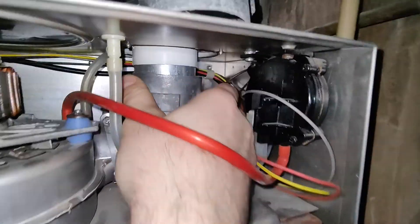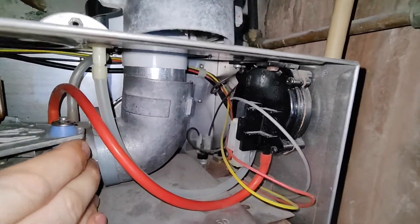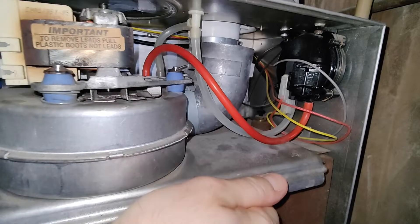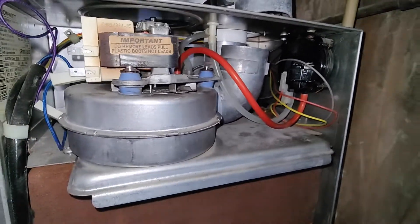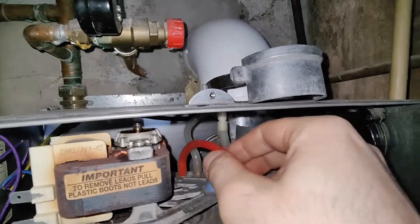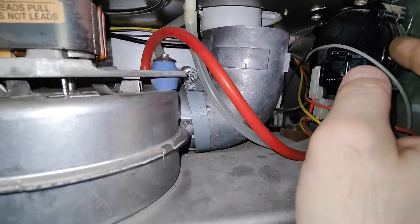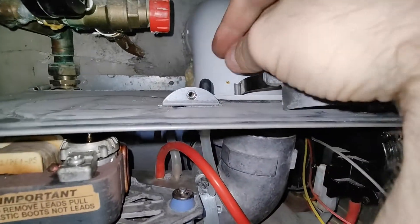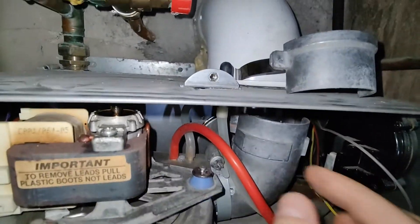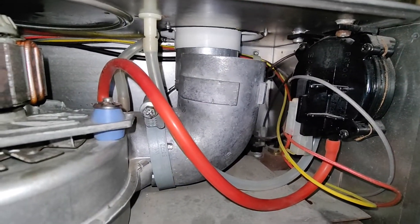The pipe is disconnected and the fan is coming out. You can see the fan on the other side there. We just need to disconnect some of the pipes here — these go to the air pressure switch and to the little sampling port on the top. Make sure to take note of the orientation and put everything back as it's supposed to be.